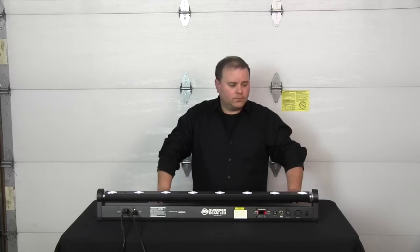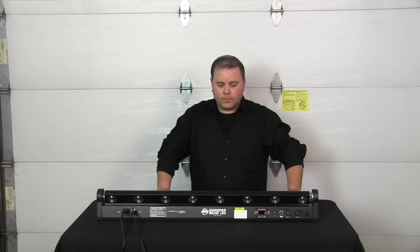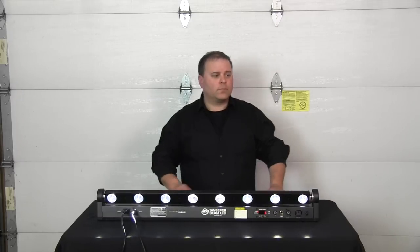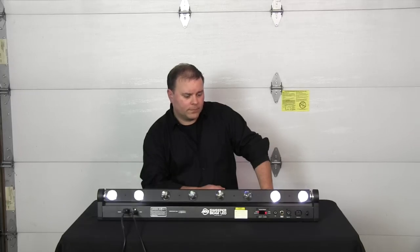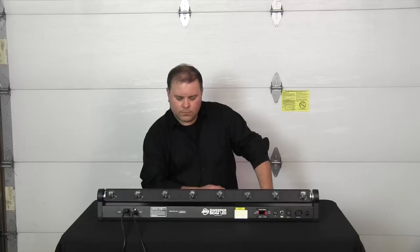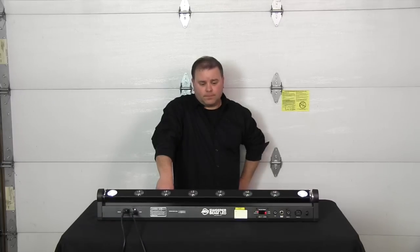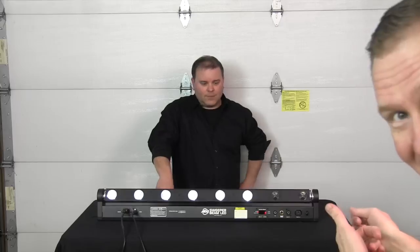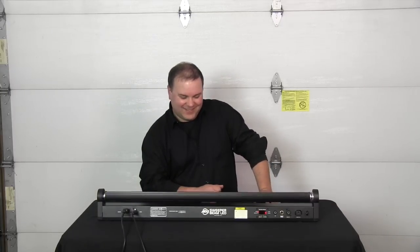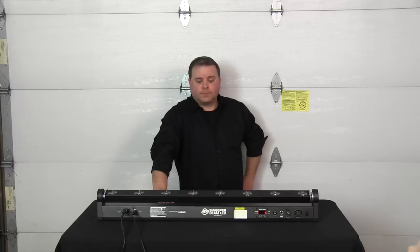Then I'm going to move it back into more of a chase mode. I can choose one of 16 different chases right now — it's doing chase 10. Here's the part I wanted to show: where we can choose the degree of movement. I'm going to set it from 30 degrees to 150 degrees, so I go to the DMX range which would be approximately 100. As you can see it is chasing, and you'll see that it's just short of all the way — I've got it set from 30 to 150.